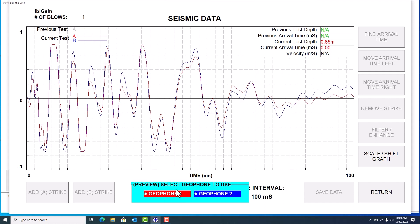These geophones are oriented 90 degrees apart from each other in the cone, so there's a good chance one geophone is going to be pointed towards your strike plate better than the other — which is why we line that up at the beginning. What we're looking for is which sound wave has the least amount of noise. One might have a little more amplification than the other. You're going to want to pick whatever geophone looks best — whichever sound wave looks cleaner using either geophone one or geophone two.